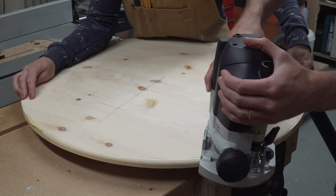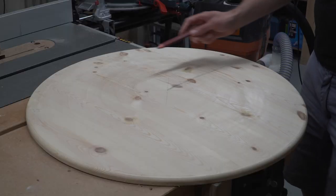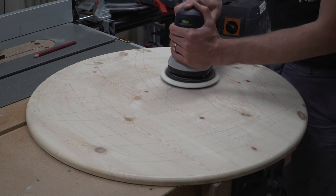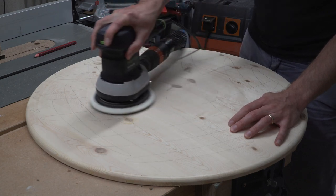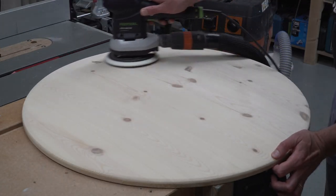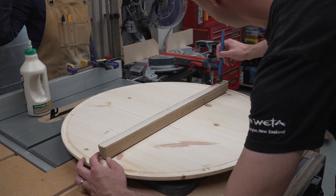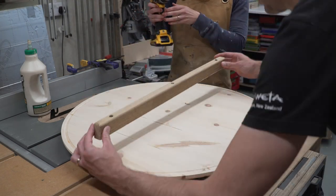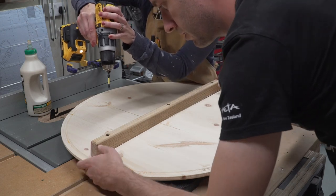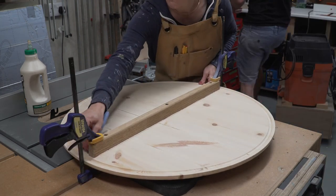Our hope was that none or very little of the filler would be visible once we added a round-over. And there you have it — you'd never know it. Just needs a final sand and we have a perfect dome shape. We're really pleased and wondering how we might apply this to other projects. Unfortunately the cover is still warped but we can fix that with a brace on the underside. We glued and screwed this, which yes is not the best plan for future movement, but we ran out of time. To do it properly we wouldn't use glue and we'd either drill the outside holes as slots, or better yet create a sliding dovetail for the brace. We might even have added this stabilizing brace before we'd started cutting the dome.